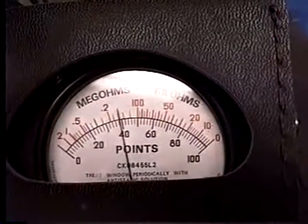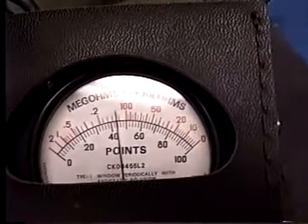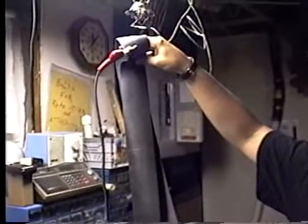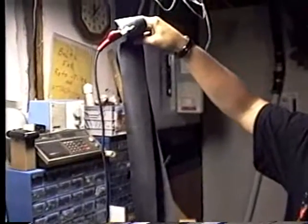So we tried it with the ohmmeter. You'll see it's about 150,000 ohms, and it's on an approximately 30-inch belt. So it does conduct — rubber belts made out of car inner tube tires are not the best product to use. And that's it for now.